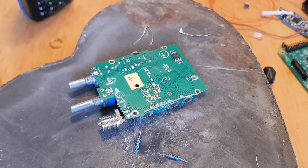So then get rid of it, across to the first 30 gauge wire, just the transistor needs to come off. And then you need to back off the heatsink. We'll need the heatsink, so then get rid of it. Then what we're going to do is remove this last inductor coil. Very easy to desolder because of course it conducts heat as well as electricity. So that just comes straight off. And then a little bit more tricky, we need to remove this trap, it's soldered in place. We're done on that side. One last bit of 30 gauge wire just needs to go to the pin on the bottom.